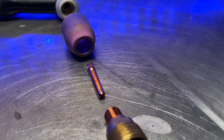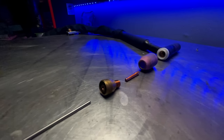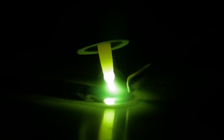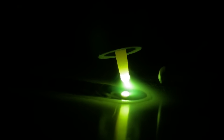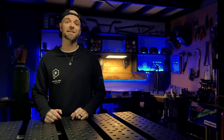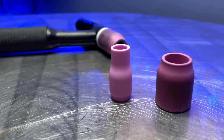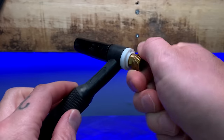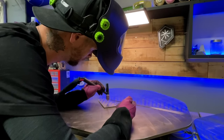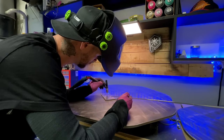When we're putting our torch together, we have multiple pieces that need to fit together perfectly. All these pieces need to form an airtight seal. This has to deliver a clean and consistent gas flow to your welding area. If any one of these tiny little fittings isn't done up properly, put together in the wrong order, or hasn't seated correctly, you're going to get contaminated welds. My online TIG welding program teaches somebody, no matter what torch they have at home, how it works, how to assemble it correctly, how to maintain it, and most importantly how to troubleshoot this first when getting off the ground with the most fundamental exercises.